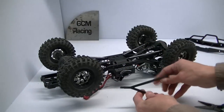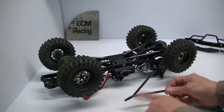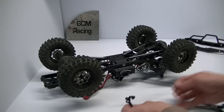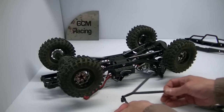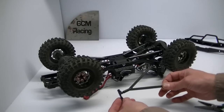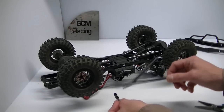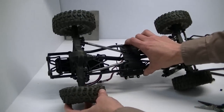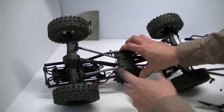This gives you a clear idea of what's actually wrong with the original design. The three-link from the original plastic part goes into this ball joint, and the ball joint fits into this part of the truss — and it just pops out all the time. These things may pivot well laterally, but there's not much resistance to it coming in or out. Now we've got our four-link on the back, and we need to put in some sort of a link up top.